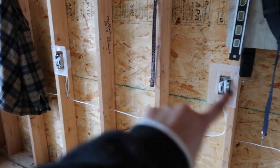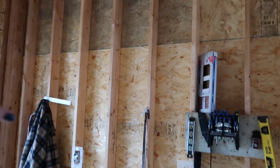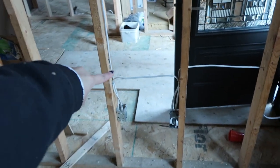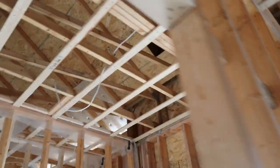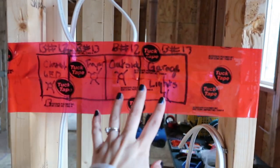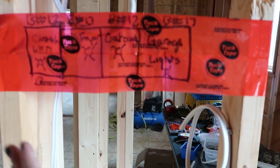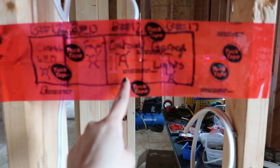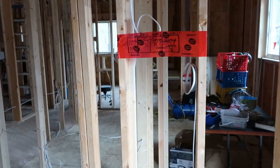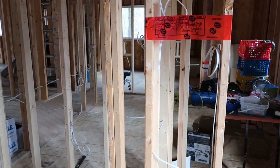Coming out of the powered box, we go across and have two outlets at desk height — I'm hoping to have a bookshelf-type thing there one day, which is why we put them at that height. Then we have one more box, another box, and also a box for the foyer which runs up to a center light and back down to power a switch. Right now it's marked on tuck tape, but there will actually be four switches here: one for the garage light, one for the light out here, one for the foyer light, and one for the closet LED. Those aren't wired yet as they're on two different circuits.